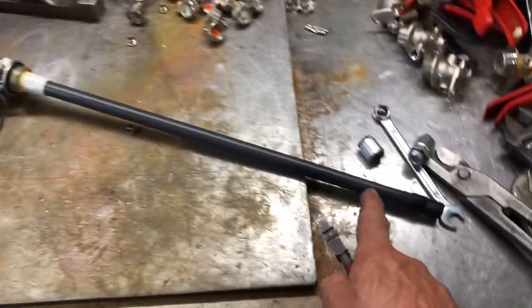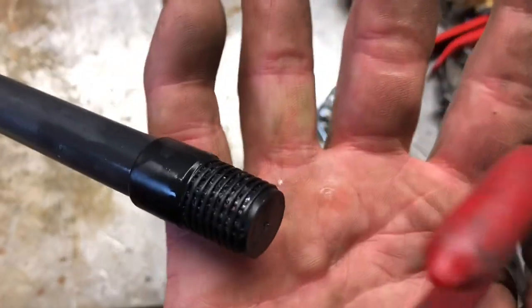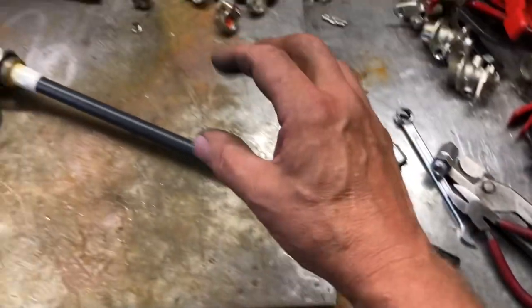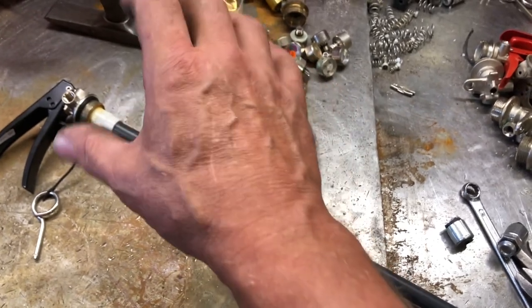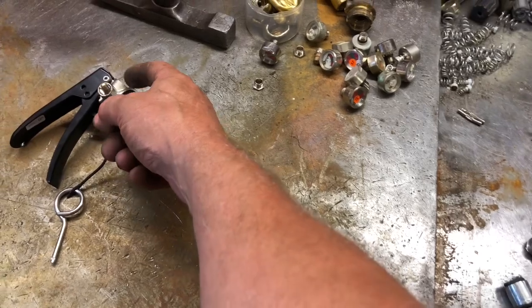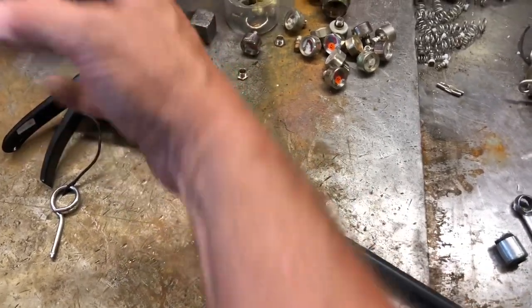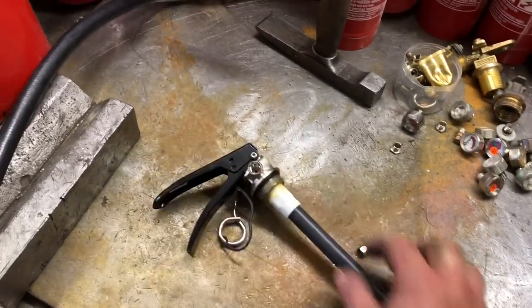Obviously, the long tube, it's got perforations at the bottom. What's going to happen, there's gas in there, because that gas is under pressure and I've pressed the handle and released a hole, then whatever's in this cylinder, the gas will want to come out, will force everything, in this case it's soapy water, up that tube and out of that nozzle.